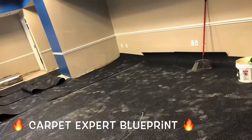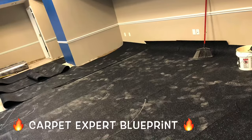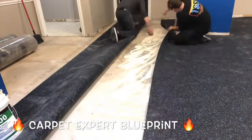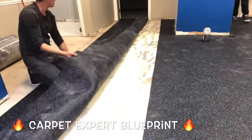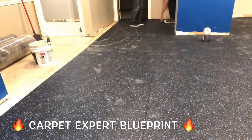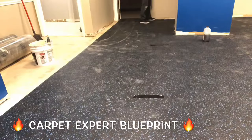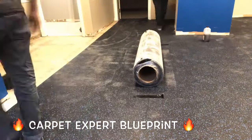Not fun. I am kind of lucky in this space — I'm probably one of the few installers doing this in my area, so we're partnered with a company that will handle the equipment for us. Just use a good adhesive. You could get away with multipurpose releasable adhesive. They have their specific adhesive that they like for rubber flooring, but it is literally like spreading a ball of tar or a gumball — nothing fun about it. So a lot of times I will improvise with the releasable adhesives.